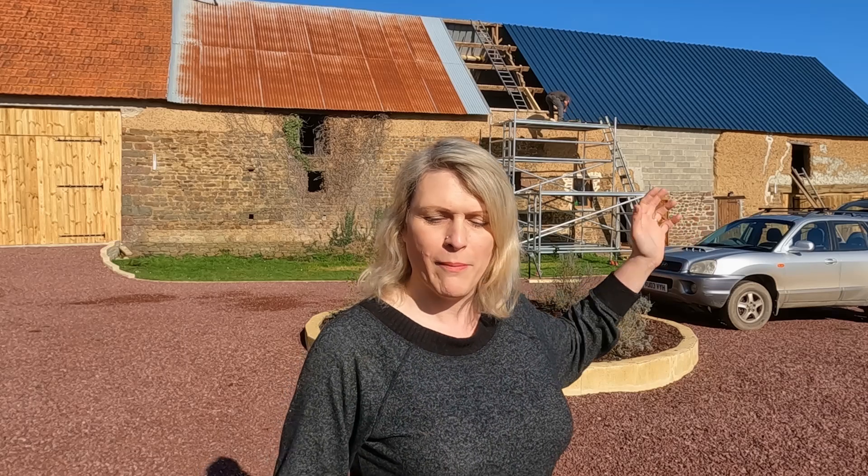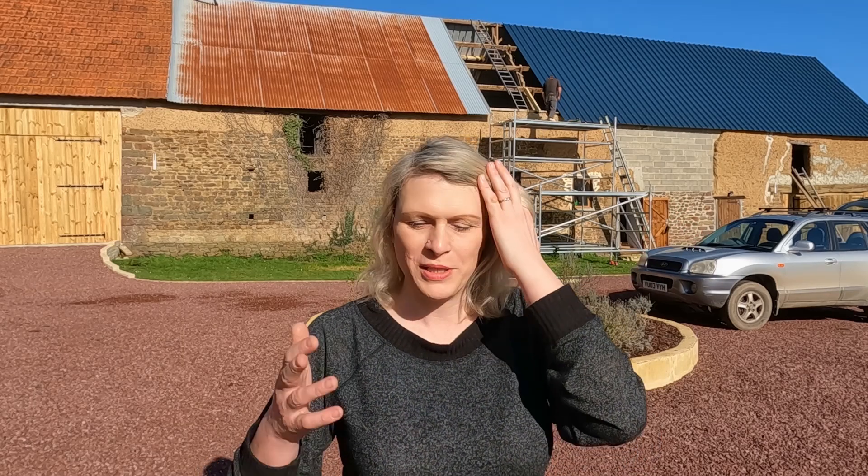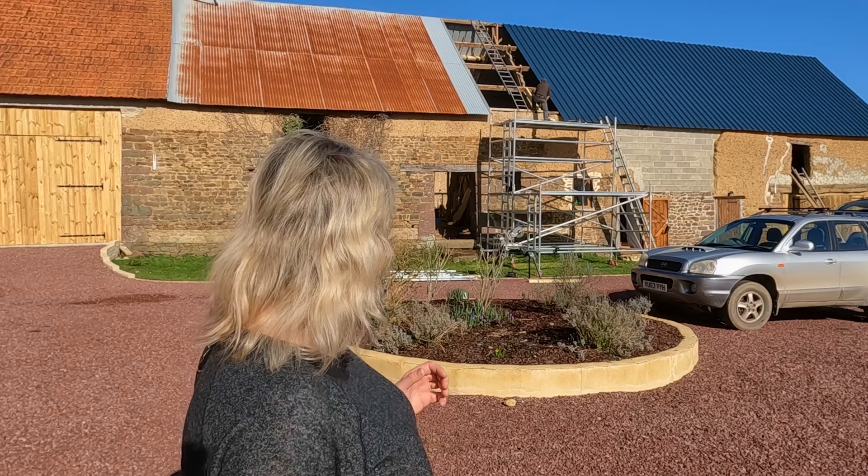It was really dumb that we didn't do it when we were originally installing the roof, but it's just one of those things. We reckon we need a little bit more timber, so this morning I was down at the timber yard at nine o'clock, put in an order for some more timber which is being delivered today. My job today is going to be cutting the lengths of wood — Jude's going to be shouting down the measurements, I'm going to be cutting and taking them up to him, he's going to be screwing them in, then we're going to be screwing the metal roofing on, and once we work our way all the way along we will screw the solar rails to the roof.